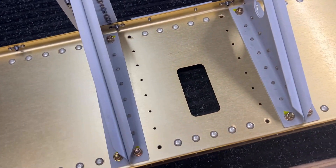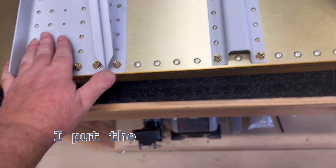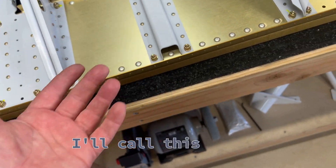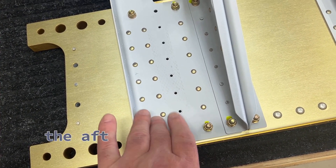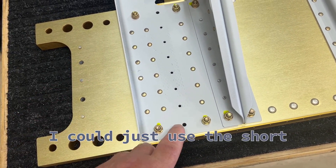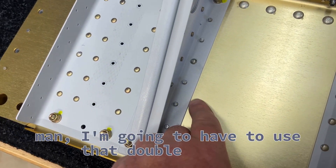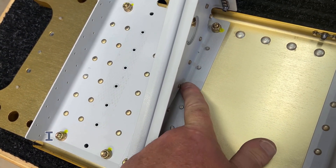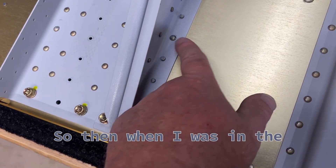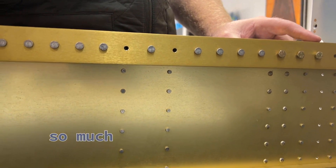The last thing I wanted to talk about was factory head versus shop head. I put the factory head on the aft side because it was easy to get to — I could just use the short little extension for my rivet gun with the universal head, no problem at all. Then when I got to the other side, I thought I'd have to use the double offset. I did one with the double offset and I absolutely hate it — I get terrible rivets. So I thought, why not just put the factory head on the other side and do the shop head here? That's what I did, and I am so much happier.